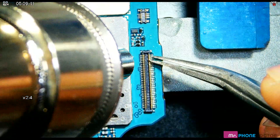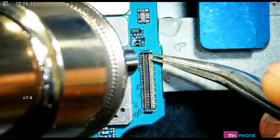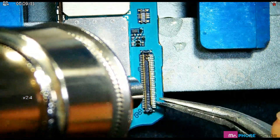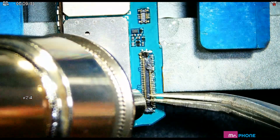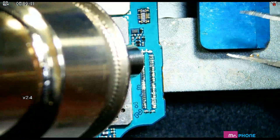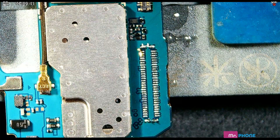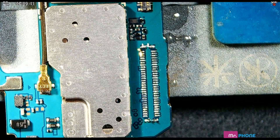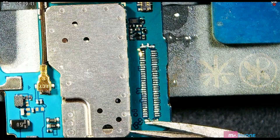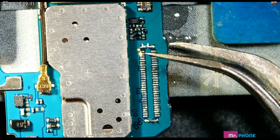This does take a little bit of coordination. You've got to go back and forth with the hot air. Make sure you're distributing the hot air evenly, because it will cool down on you and these do tend to just break right off. There we go — beauty, sucker blew right off. It's not like our trinoculars that we use daily, but you can see everything. This solder was pretty good — you didn't see any kind of pads tear on here, so everything looks intact.